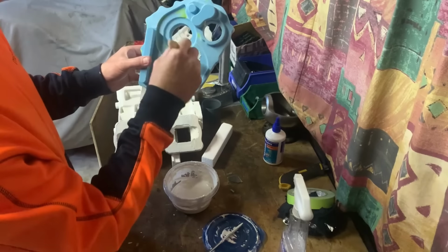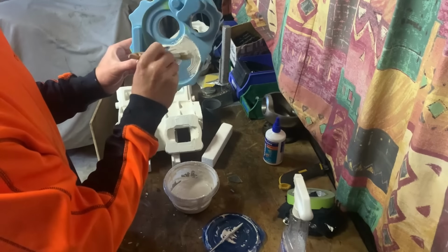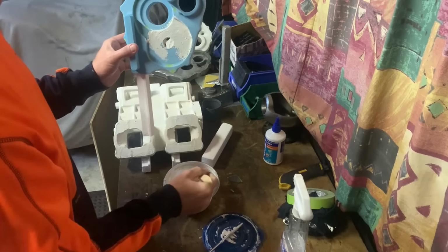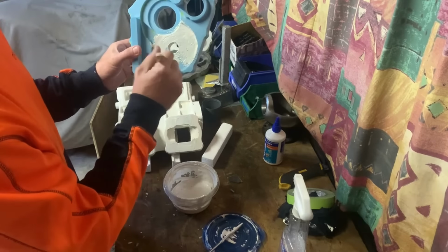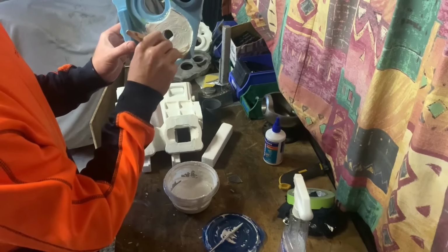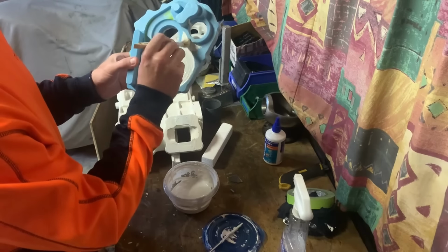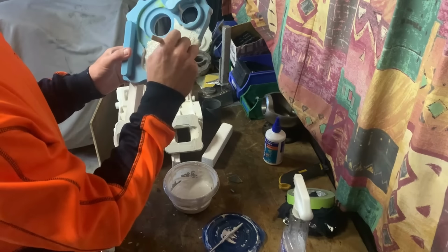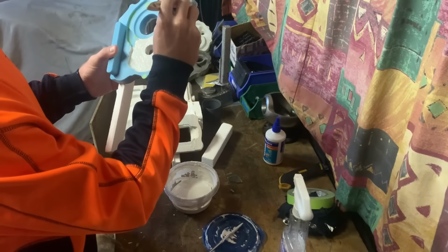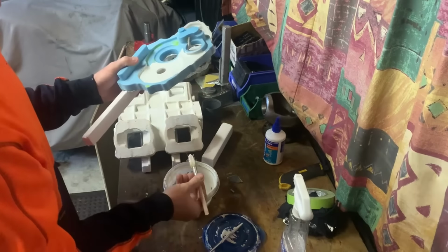See on here, all this yellow stuff, that's fiberglass filleting wax, or essentially it's just a really low temperature wax, so you can just about melt it with your fingertips, and you just smooth it. You want to use it sparingly, because obviously polystyrene uses not very much energy to burn it, so it takes very little out of the aluminium, but the density or the energy requirement to melt the wax is a lot higher.